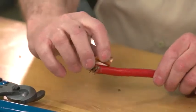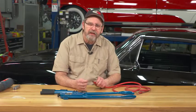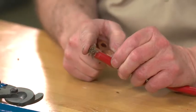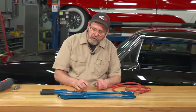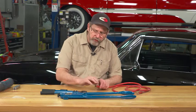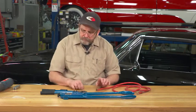You could cut this cable and solder a terminal on, but I don't like soldering them much. The problem is you have to put so much heat into the cable that you end up melting back the insulation. So we're going to look at the process to cut the wire and then crimp the new terminal on using a lug crimper.